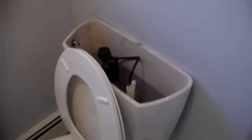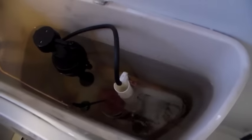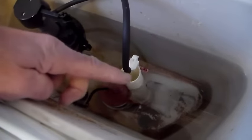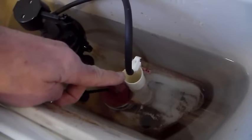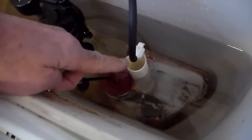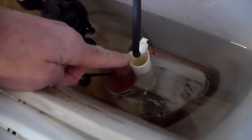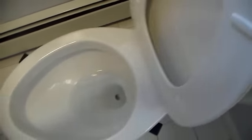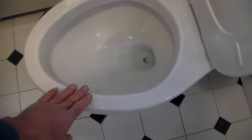So what you do is you heat up some white vinegar — about 10 or 12 ounces of it — and then you bring that 120-degree vinegar over here with a funnel, and you pour it down the overflow pipe. You just let that warm vinegar sit in there for an hour to an hour and a half. Naturally, it will be sitting on top of the rim jets.